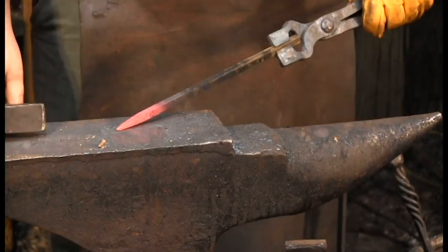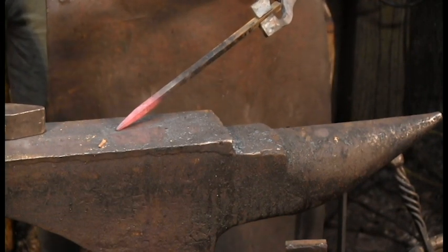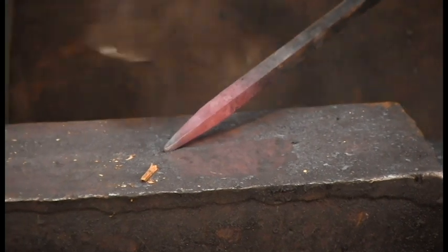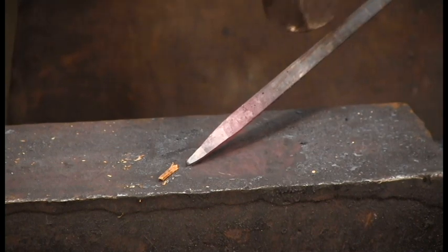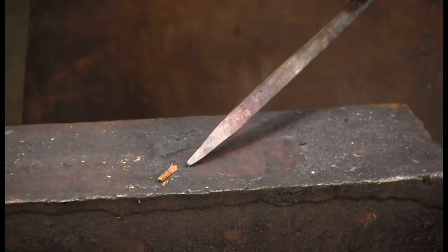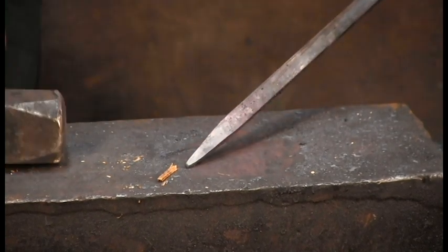You can see that this is not a meat skewer. A lot of people have the tendency to make that tip really, really sharp — it's not necessary. Unless you're going to curl it to make a decorative tip, don't make it overly sharp; there's no reason to do that. I'm going to take one more heat — you can see this has square edges. I like to knock the edges off for the hook. I'm not going to do it all the way to the center, because we're going to do a special twist, the blacksmith's twist, in the middle of this piece — you want those sharp edges in the middle. But coming back about three or four inches, I'm going to knock those edges off.